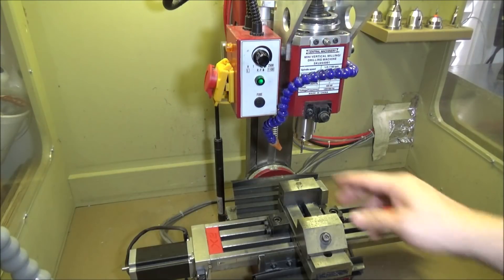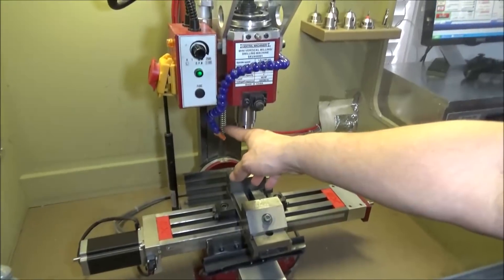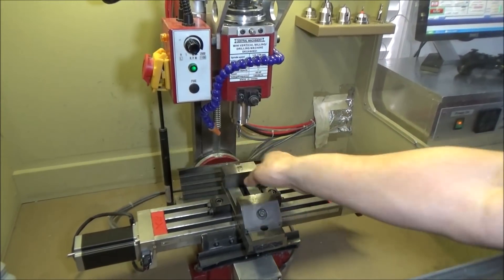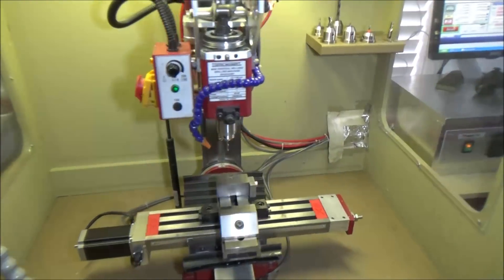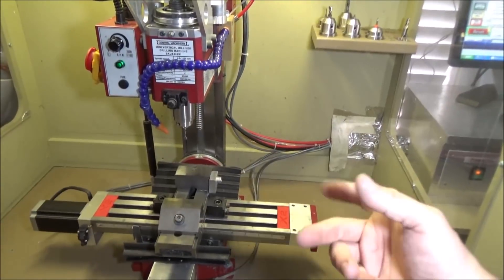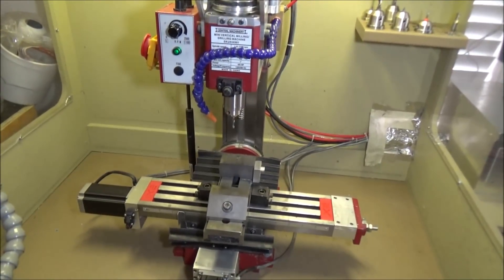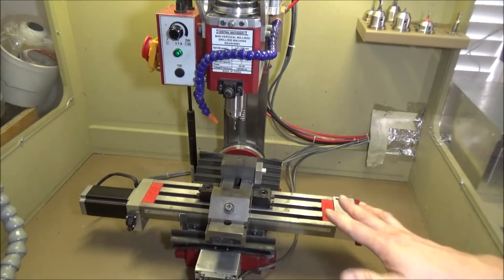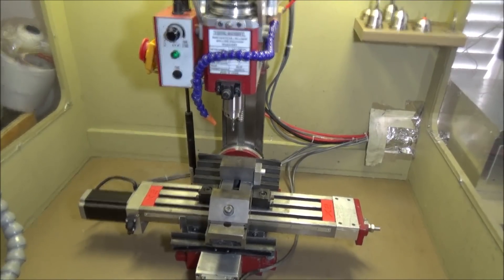It's going to come with this — it's connected to an air pump that blows air onto the tool path to clear chips out of the way. It works really well. I give it a spritz of alcohol every once in a while to keep the tools cool — I don't run flood or mist coolant, but you could.